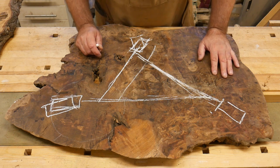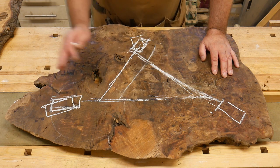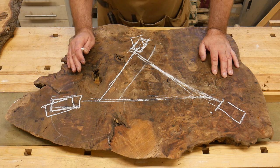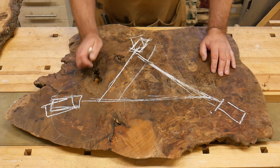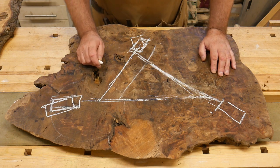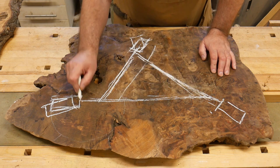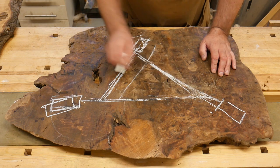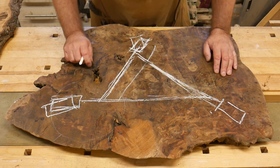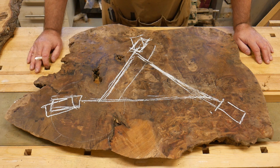This is the underside of the tabletop and I'm trying to work out where I'm going to put the legs. I only want three legs on this, and I don't want to have two tenons meeting at an acute angle — that's not going to be very good at all. So I'm going to arrange it in a legs-of-man type arrangement: a rail here with a leg on the end of it joining into a rail that has a leg onto it, and this leg rail joins in there. It'll be a sort of triangle with the corners extended, and I think that will look quite nice.